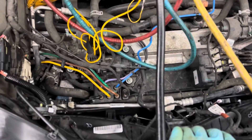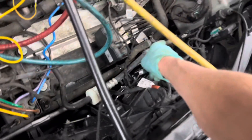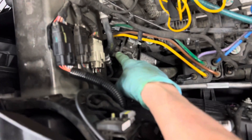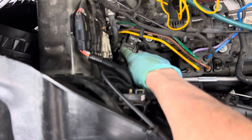Let's look a little bit more at the air conditioning. We have a condenser over there with a fan, and a condenser over here with a fan. We have a crossover coming from that condenser going over to this condenser. Then we come out at the liquid line right there that I explained in a previous video — it's kinked over, really jammed from where the ferrule is, pushing it up into the frame and against the motor of the three-way valve.